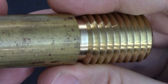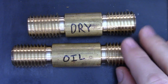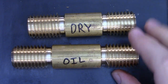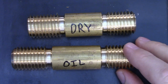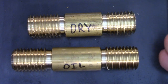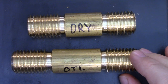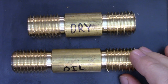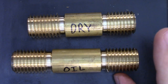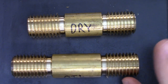There are a few possibilities that come to mind as to why. First, there's just a lot of contact between the tool and the part, although I would still expect more chatter on the cross feed samples and I really don't see a difference between them at all — I guess that answers my original question. Flexing the part or the tool is probably negligible since neither was sticking out terribly far. The center height of the tool could have an impact, especially in a grabby material like brass, but I was very careful when centering the tool so I think it's the least likely option.